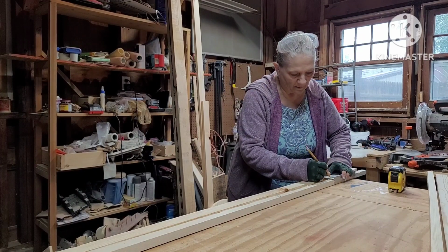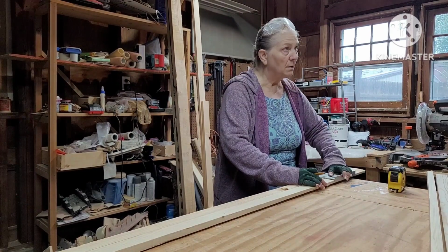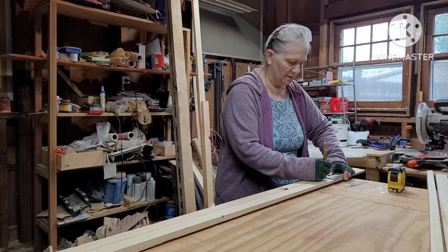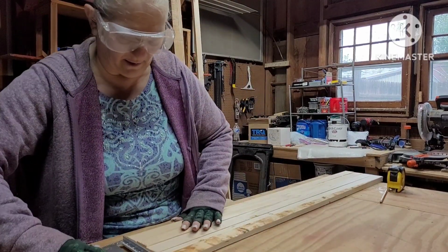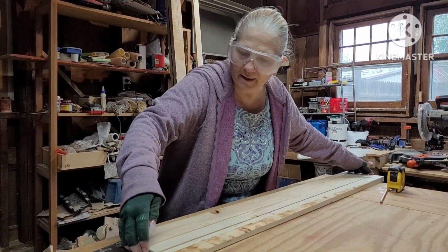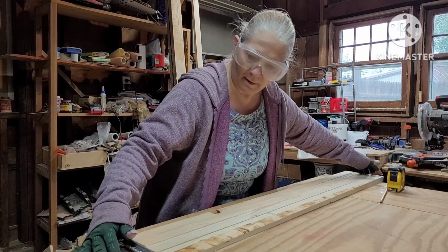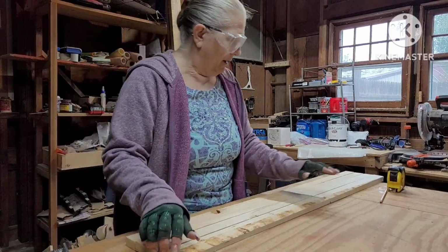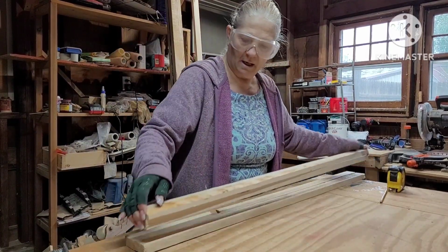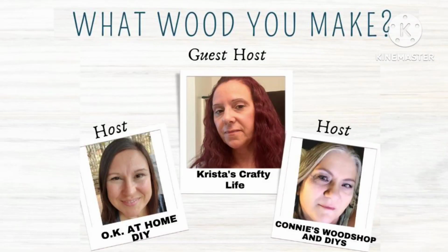The reason why I'm putting slats on the bottom two is because that's where his shoes and my slippers or shoes will sit. So the garbage can will sit underneath it, so that way the stuff can just fall off our shoes if there's anything on there. I'm making sure that the first shelf is going to give 15 inches clearance for the garbage can to sit under.